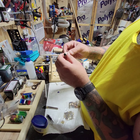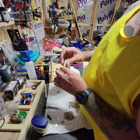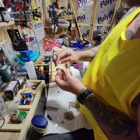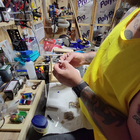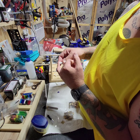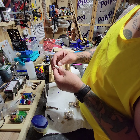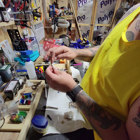What I like to do is leave a little bit hanging over the edge, just a hair. Whenever I get everything done and get this cased in resin and dried, I'll put it on my sander and sand the ends flush. That way any epoxy that's leached over the edge will all come flush to the edge. I found that when I cut it right on the edge of the barrel and then sanded flush, it would cut the fiberglass down and you could see the barrel. So just leave a little bit hanging over the edge.